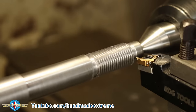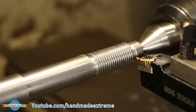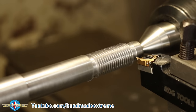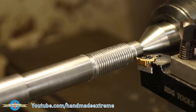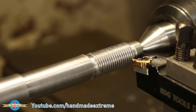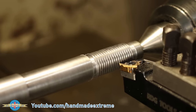Here's a little tip: because I've swapped the tool out and done other operations, what I like to do is just put the tool back in, get the machine going, and then do a cut without any depth of cut — just to check that the tool lines up with the root of the thread. Numbers coming around slowly — nearly there — engage. I'm just watching the tool to make sure it lines up with the root of the thread, which seems to be doing reasonably well.